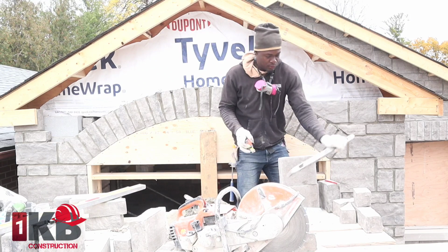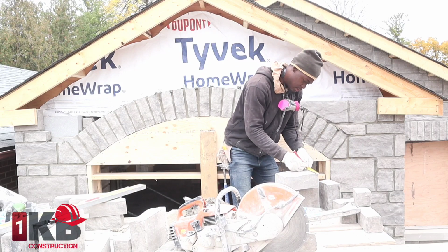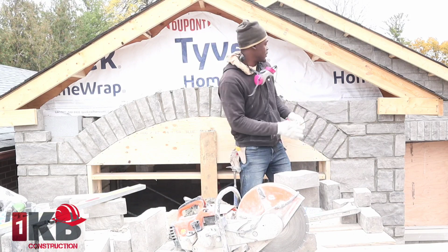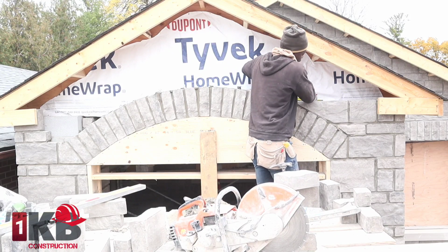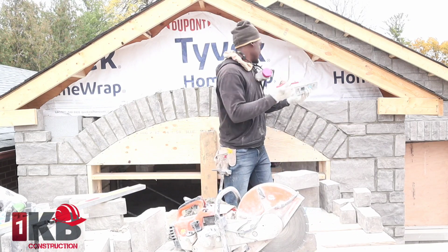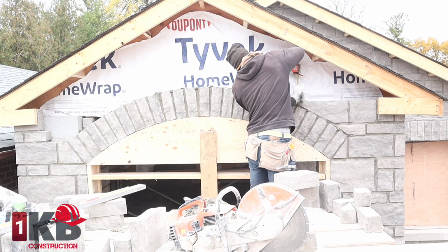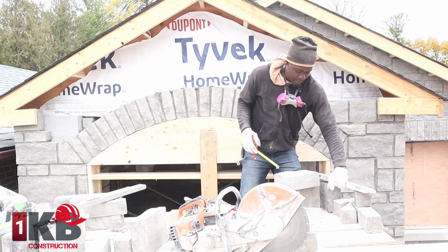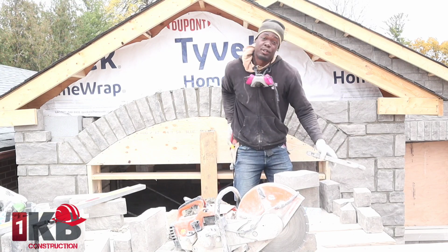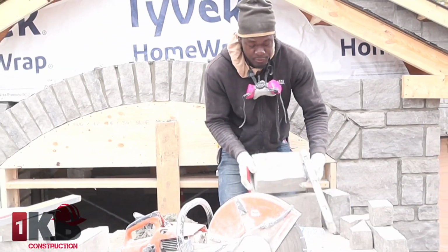It's 6 inches. I want to take our measurement from the top down. It's 6 inches. And remember, catch the measurement of our stone, which is 9 inches. Don't worry guys, you will catch on as we go. It looks a bit complicated, but you'll see. Try and watch the video till the end. And here, 1.5. So from this point, from the top down, I want to catch 1.5. And then we're gonna score it across just like how we did the one before. Just like so.